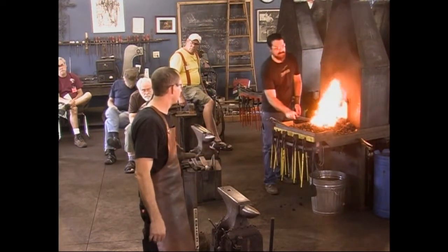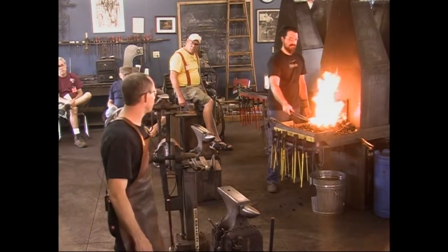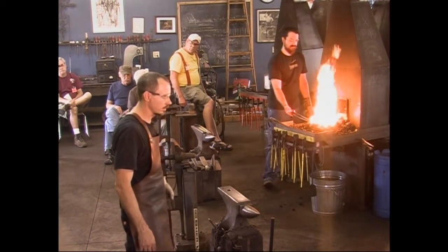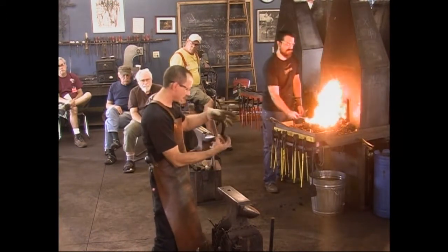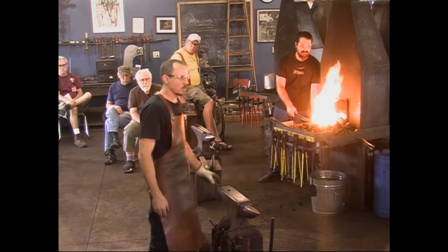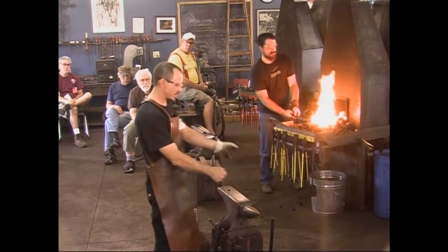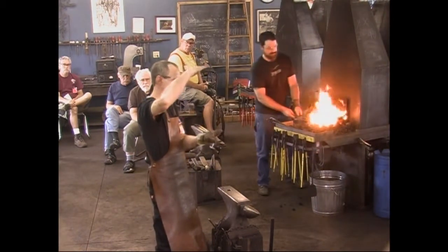Now, there's a significant difference between shaping these on the anvil with a striker and shaping them in a power hammer. Because we started here working on the anvil, the first thing we did is begin to create a hardy shank so we can sit it in the hardy hole. You don't necessarily have that luxury with the power hammer because it's taller. I tried that once at work, and by the time I had the shank drawn out, I put it in there and the hammer dies would go clink, clink, clink.